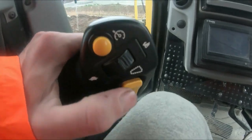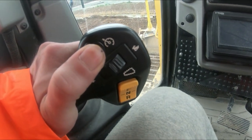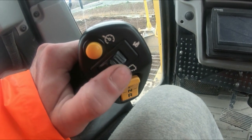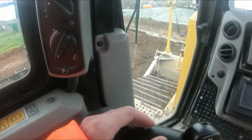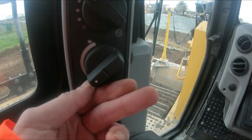The steering is left to go left, right to go right. This is basically like a cruise control — you hold that, set your revs on your deaccelerator, push it in, and it'll basically hold the machine at those revs and that speed for you. Then you've got up gear, down gear, forwards, neutral, and reverse.